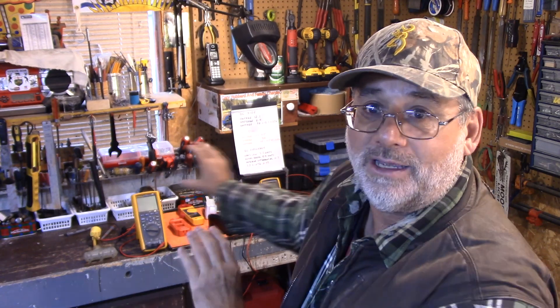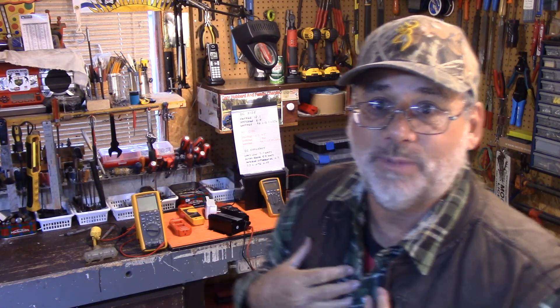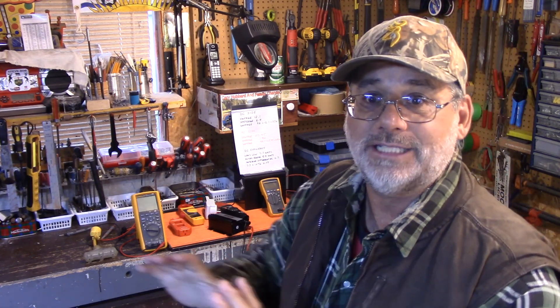In my experience, if your appliances are close to your batteries, DC may be a good choice. But if they're a distance apart — like in my case, I've got quite a large distance between where my fridge is and where my battery bank is — I would have to run huge cables to bridge that distance, and for me it's not really feasible. I prefer going the inverter way, and I find it's the most economical as well. You just have to know the losses — in this particular situation, it's a 10% loss.